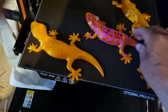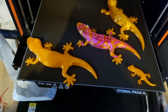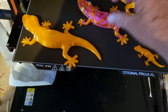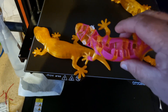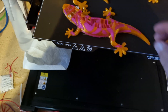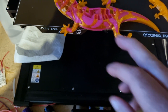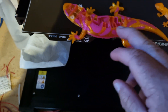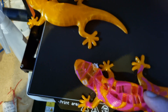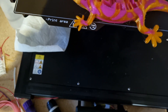Unfortunately, what happened was I had some TPE labeled as TPU for the black eyes — that's where it jammed and stopped the print. So this print didn't finish. But you can see some interesting things: when you paint in OrcaSlicer or whatever, you might think you're only printing the skin with 0% infill, but what actually happens is these little ridges in the back go right the way through.